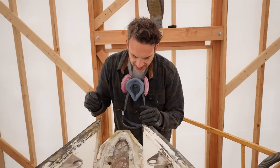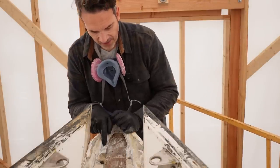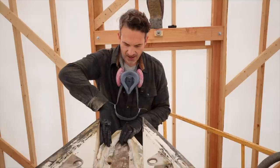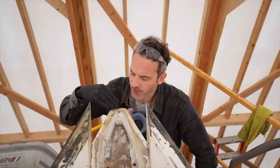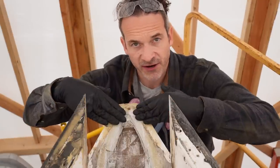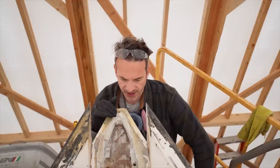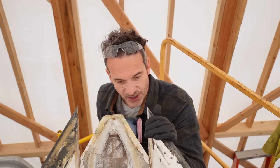This has actually worked out pretty well. I can see my furthest port side hole came out here, and then I have one that was behind it that came out on more of an angle just behind it. My forward most starboard hole is here, and I think the other one is through here somewhere — it hasn't even come up yet, so I think I'm pretty safe to work this area down. We're going to start sculpting some of this back to try to get a nice angle on here, cut back into the hull laminate a little bit, and put a nice angle on that to get a nice long surface area for the new glass to bond onto and area for that G10 to get in here. We're going to be using this Makita tool — this one's brand new, getting its inaugural voyage today.